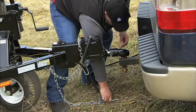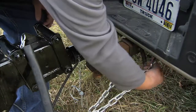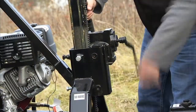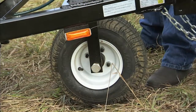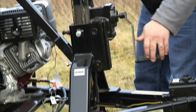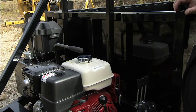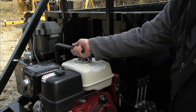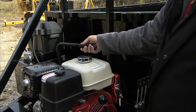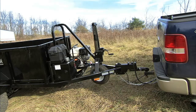Plug in the electric, hook up the safety chains and breakaway cable, and raise the front tire — check to be sure the front tire is raised all the way up. Now put the transfer case into neutral. You can tell it's in neutral by pushing the pump control handle forward while the engine is running; if the dump trailer does not move, you're in neutral. You can then shut off the engine. Your dump trailer is now ready to be towed.